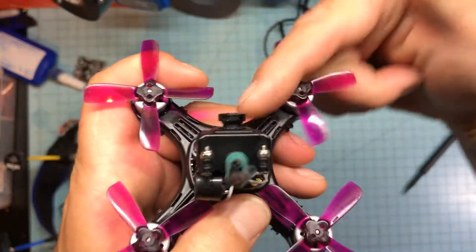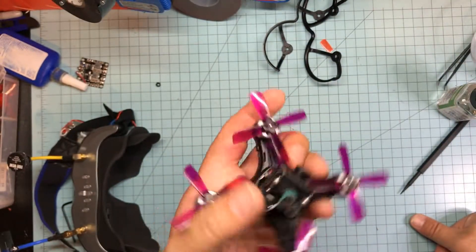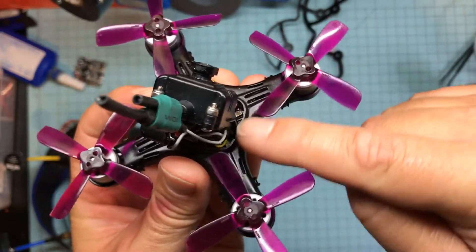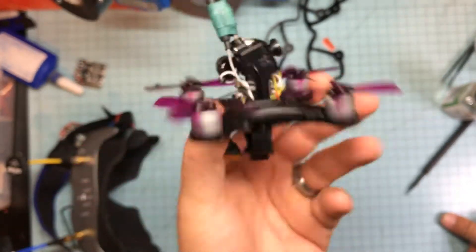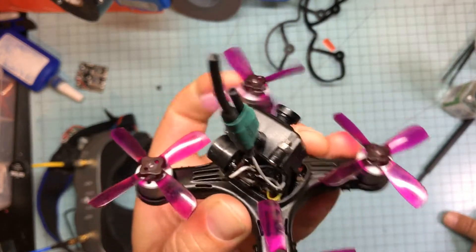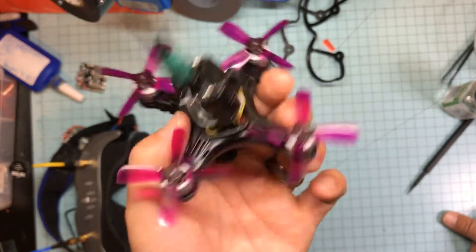You have to move a wire — Motor 4. If you update Betaflight and enable DShot, Motor 4 will not spin. I believe that was an SP Racing F3 Evo issue as well. You actually have to move the signal wire to the third hole down on the right-hand side of the board, remap your motors in Betaflight CLI, then enable DShot 600. I've had this thing apart like six times before I even flew it. I don't understand why Emax, if they're using ESCs that support DShot, wouldn't set it up from the factory like that.